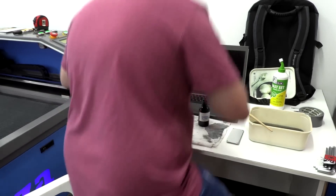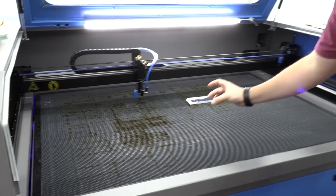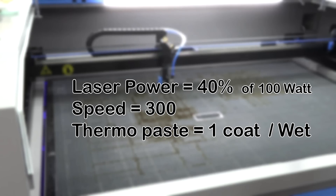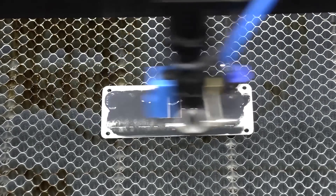Today we are going to conduct four tests of engraving on metal at different settings to find out what the best results are. Test one: laser power 40% of 100 watts, speed 300, using one coat of thermopaste, still wet.